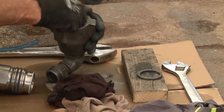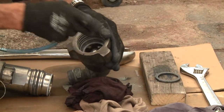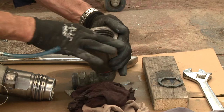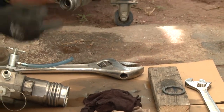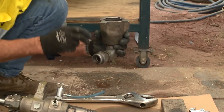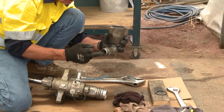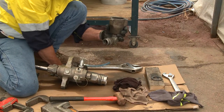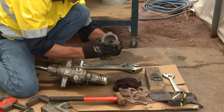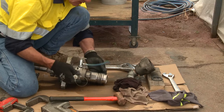To test the ball, sit it back in the housing and put the cage back in without the shims. Push it all the way home so it sits on the seat. Tip some solvent in and hold it still — if the ball has been compromised, fluid will leak out. If the ball hasn't been compromised it will maintain a seal and there'll be no fluid exit. That completes the primary foot valve inspection.